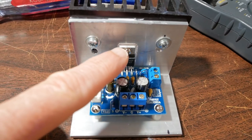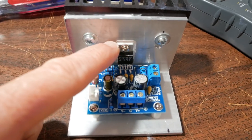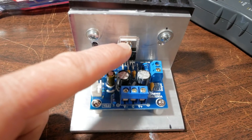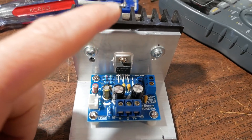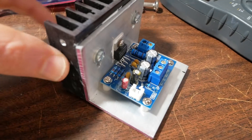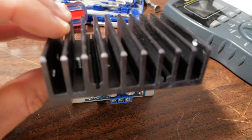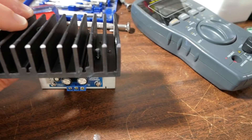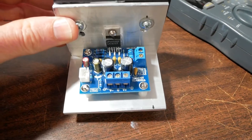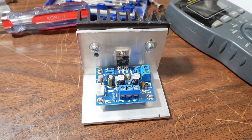Okay, we're all finished. To keep the tab, which is on the negative supply rail, isolated from the heat sink, I used a mica washer — greased it up with heat sink compound on both sides. Used an insulating shouldered washer and screwed it in there. I drilled a relief hole in this heat sink so the back tip of the screw wouldn't touch it and short it out. The position of these were important because I wanted to drill the holes between the fins and tap it — that's why I couldn't use those other holes. But this thing's pretty much done. Stuck some anti-slip feet on the bottom. And that's it.